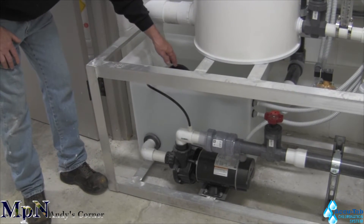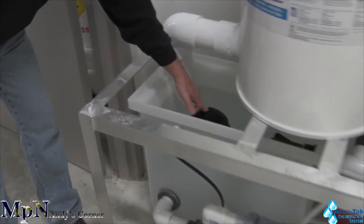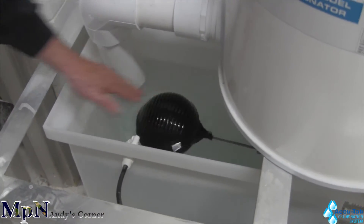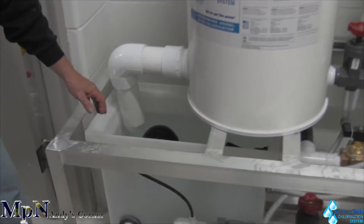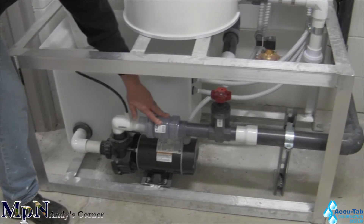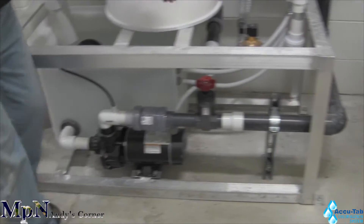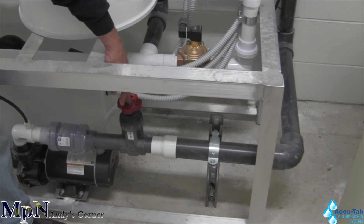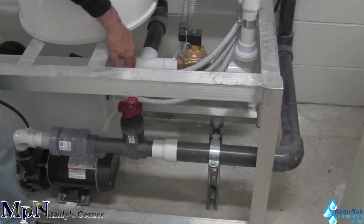It'll drop down into the holding tank. Inside the holding tank we have a float-operated valve — a plastic valve that maintains water in the bottom so that you can control how much chlorine goes in. It's picked up by the booster pump, goes through another check valve, and an output adjustment valve.